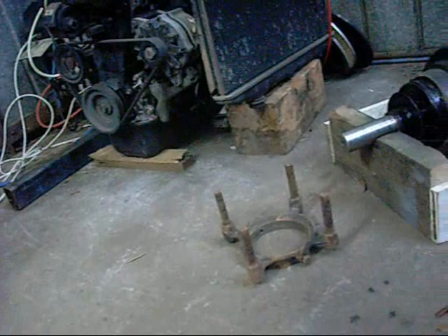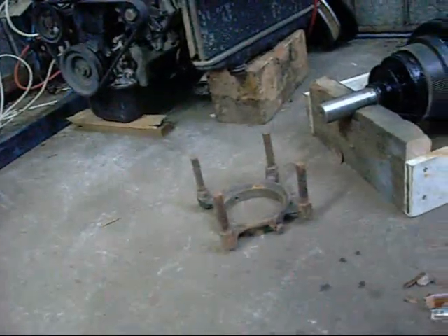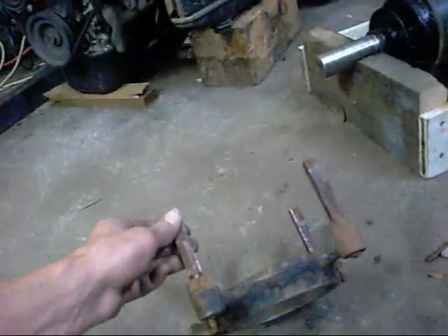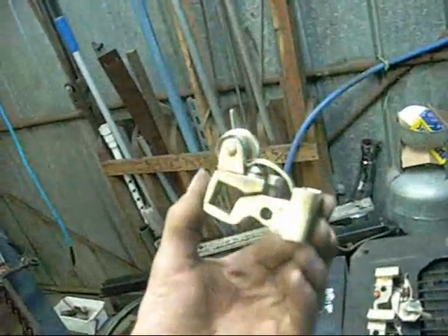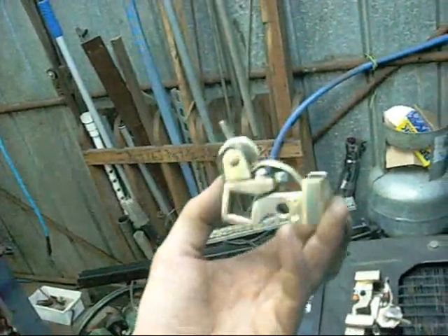I've got the brush assembly apart, cleaned off all the old insulation which is just degraded and rusted up — layers of waxed cardboard which is mostly rust now, and a bit of mica. It probably would have arced through if I'd loaded this thing up as it was. The actual brush retainer can go into the electrolysis tank tomorrow, and the brush boxes I'm just cleaning up on the grinder using a wire wheel — coming up beautiful.